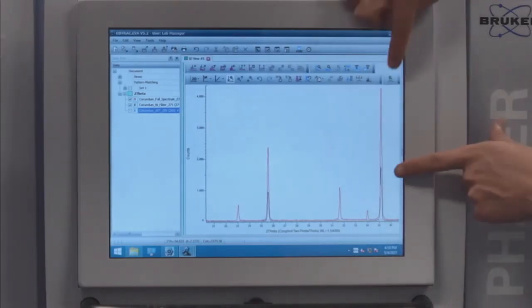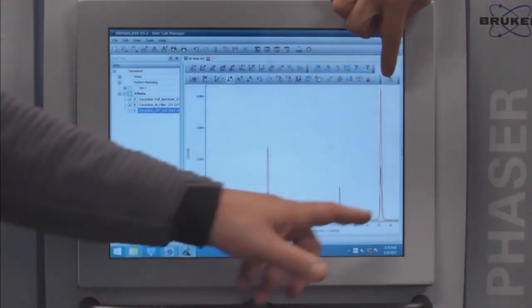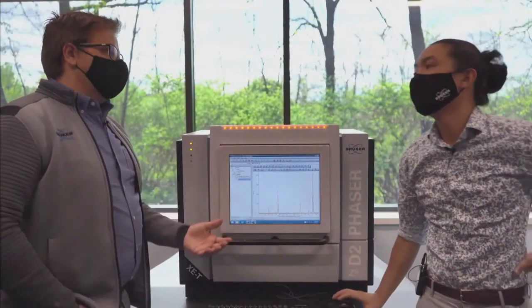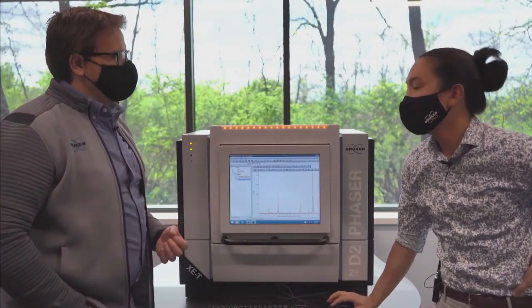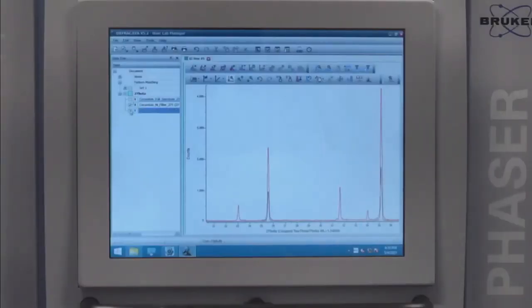But what we see is a pretty significant drop in intensity, about a factor of 2. We see that on those peaks. And like you said, the K-beta is completely wiped out. Totally gone. But I do take a hit in terms of my actual intensity, so I'd have to collect twice as long to get the same quality of data. Exactly. All right. So if I turn on the scan for the XE-T, what we should see here is,